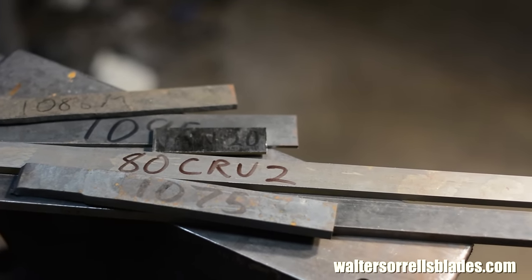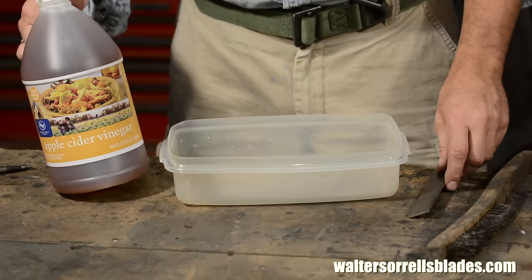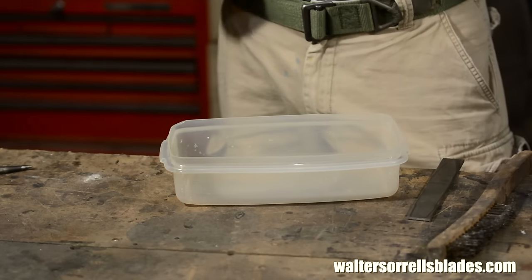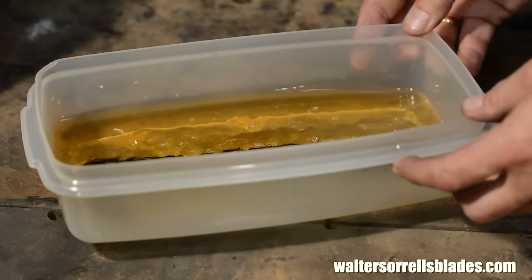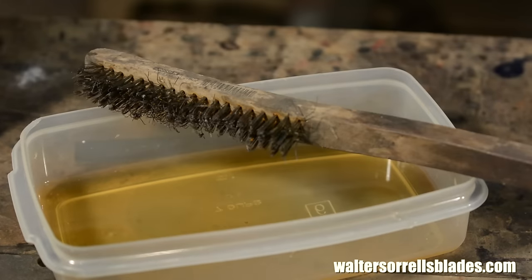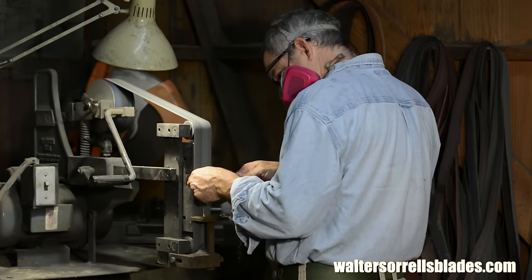One of the biggest annoyances in knife making is mill scale — an oxide formed when hot steel meets air. It's extremely hard stuff, harder than steel itself, which means you want to clean it off before doing anything else, otherwise it'll dull your tools. If you're a pro, you can use a belt grinder, surface grinder, or abrasive tumbler. If you're a beginner, go raid your kitchen for vinegar and a Tupperware pan. Pour in the vinegar, let it sit overnight or maybe even a couple of days, then use a $5 welder's brush to get rid of all the scale. I'm grinding the scale off on my belt grinder.